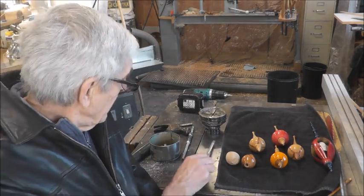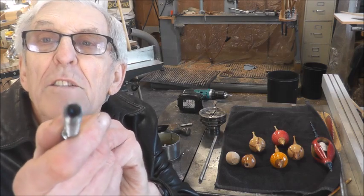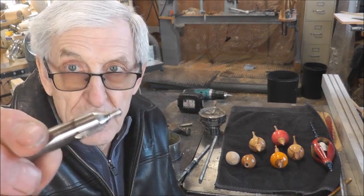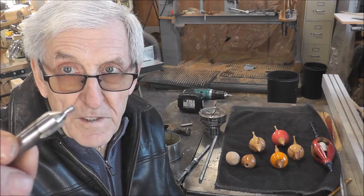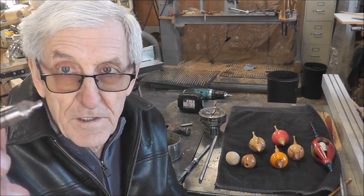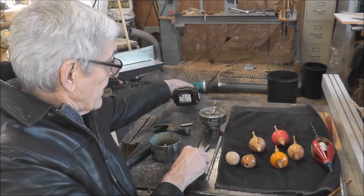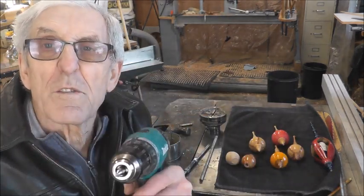The first thing you have to do — I've got one made here — is put a hole in the end that matches up to a live center on your wood lathe. To do that, you need one of these center drills. I use these all the time in woodturning for spindles, because it's made for the 60-degree live centers. It's actually more used for metal work on the metal lathe, but I use them in the drill all the time. They come in various sizes, and you should have one of those drill bits no matter what.